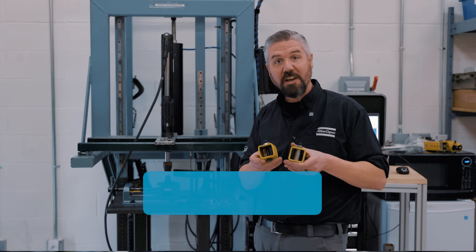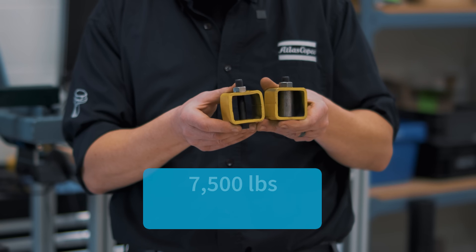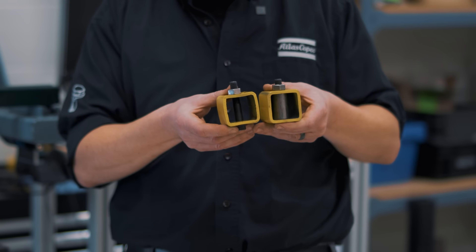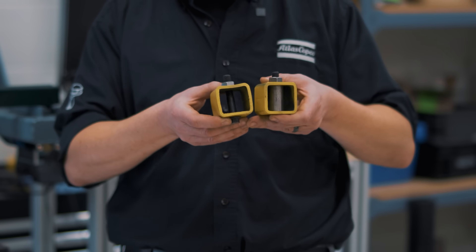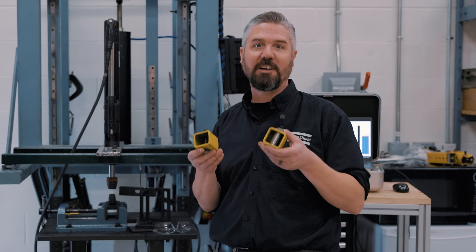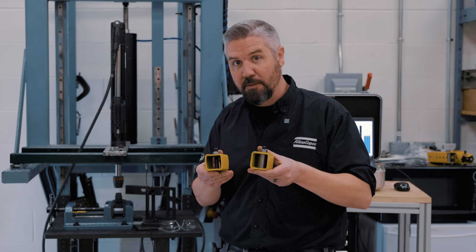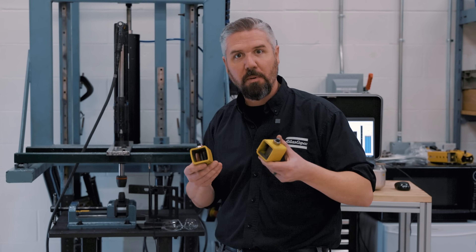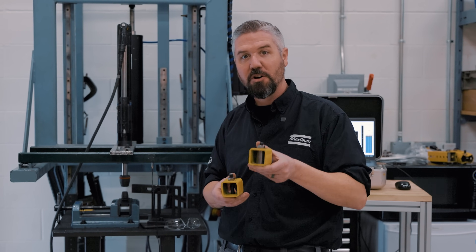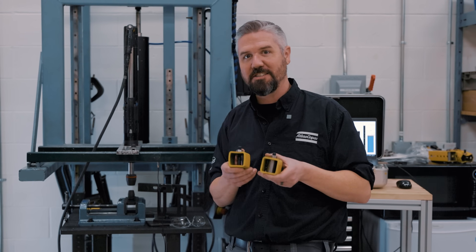The tube without the spacer only had 7,500 pounds. Now we can see the difference in deformation between these two. This really tells us about the importance of making sure the parts we're clamping together are strong enough to handle the huge amount of clamping force that the bolt can generate. So remember, when you're building something and trying to make a strong, robust assembly, we really have to make sure we've got everything in place and have tons of clamping force. All right, we'll see you next time.